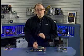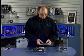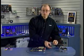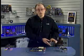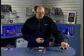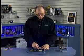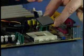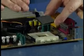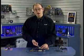Intel took a different solution to the cracking die problem, which they were also having with the Pentium 3 — the Pentium 3 looks similar to the way the AMD Athlon looked. What Intel did with the Pentium 4 is install what's called a heat spreader: a metal piece that completely covers the die and also takes all of the force from the heat sink and spreads it out on top of the processor.